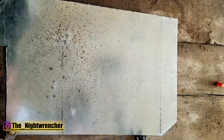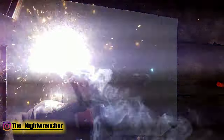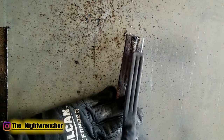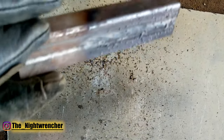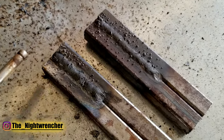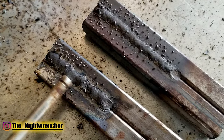Let's go ahead and switch the process over. We're going to move the material we used to wave and now we're going to weld in a straight shot all the way through. After brushing this down and knocking off the slag with the slag hammer, you still get that stack of dimes look. We've got the weave on the left and the straight shot on the right, and you can tell right away the weave weld is a lot wider than the straight weld, but the straight weld is a little bit more uniform than the weave weld.